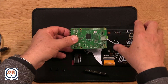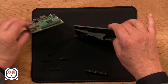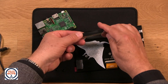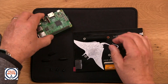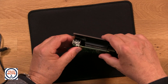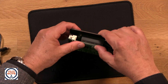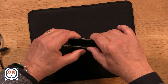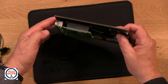You could try to put this on there, but you're going to see it's too thick — that's why you have this. This is a little standoff, it just plugs in here, pushes in there, and then it's just the right depth that the Raspberry Pi, when plugged into the standoff — and you're going to want to do this more carefully than Leo is, and you're probably going to want to ground yourself — and now this is mounted as part of a single unit. You could hang this on the wall, for instance.